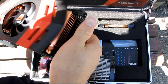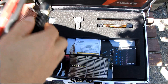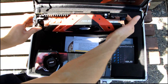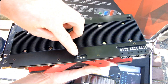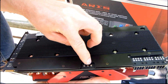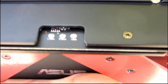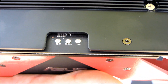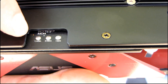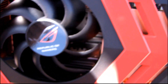This thing weighs easily double a GTX 480. You would never want to ship your system with one of these installed. Along the lines of voltage tweaking, you can use contact points on the back to check your video card voltages for GPU1 and GPU2 using a multimeter — a pretty cool feature we've seen on motherboards before but very rarely on a graphics card.